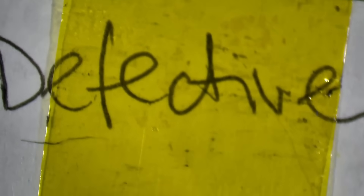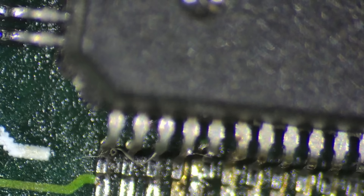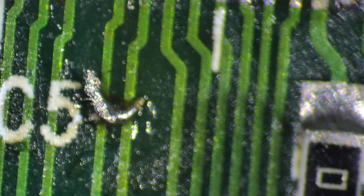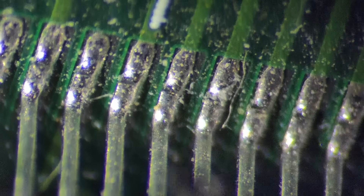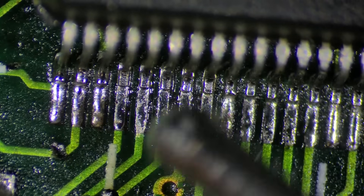I also had a look at the Orchid Righteous 3D, and it is one of the very common issues you get on Voodoo cards — detached pins. Someone worked on this card before, but unfortunately either they didn't use the correct tools or they didn't have proper magnification. You can make things worse even while trying to make them better. All I did was reflow the pins around the TMU chip. The FBI chip was surprisingly okay — it was only an issue around the TMU chip. I cleaned up the card and removed all the solder blobs scattered over it. There was even one stuck to pins on the FBI chip. There's no point testing a card that is clearly having issues and risk making things worse.